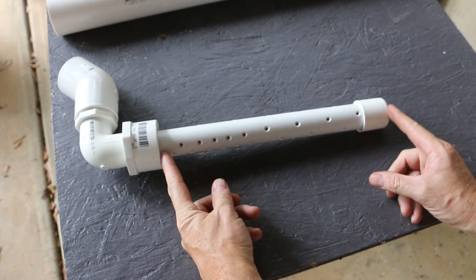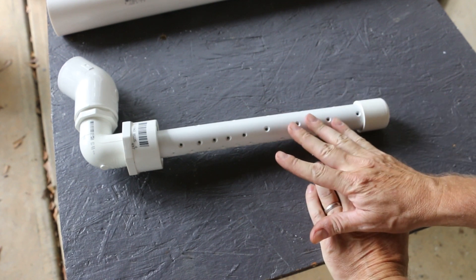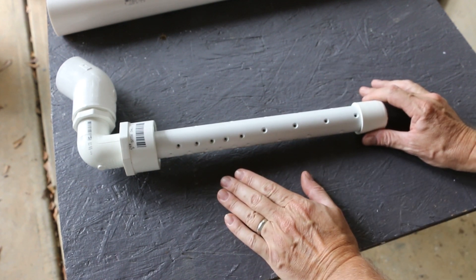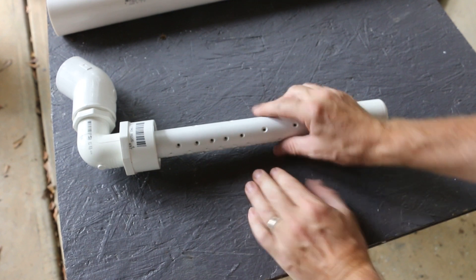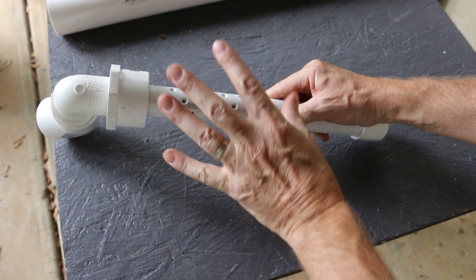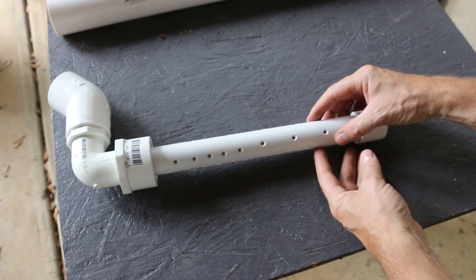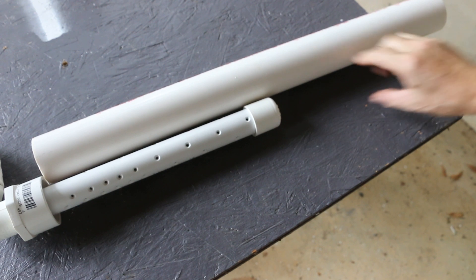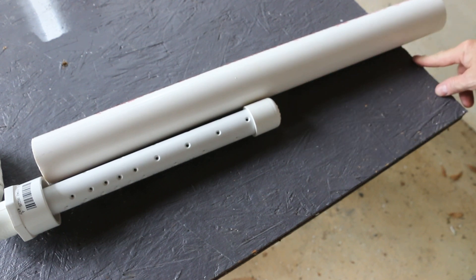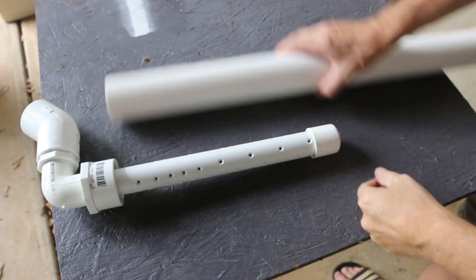I'm not sure I'm going to need all 12 inches of this diffusion, which is why I just dry-fitted this cap — I'm going to test it like this. My thinking is that because I'm operating with lower pressure, more turbulence is going to be better. So the majority of the airflow hits in this lower section where most of the holes are facing down into the liquid, and then as it generates foam, these other jets agitate it some more as it's coming up the tube. Of course the screen section comes in in the top half of the reservoir. One question I have is: is this enough screen? By shortening the diffusion section I could get more screen in there.